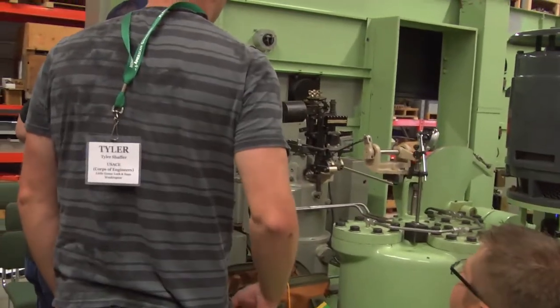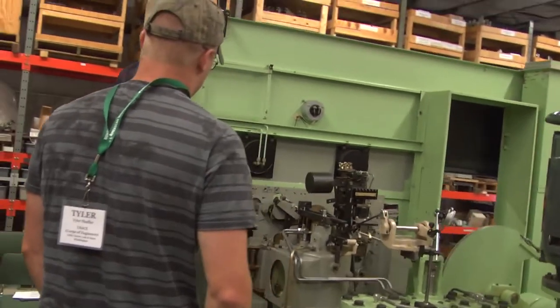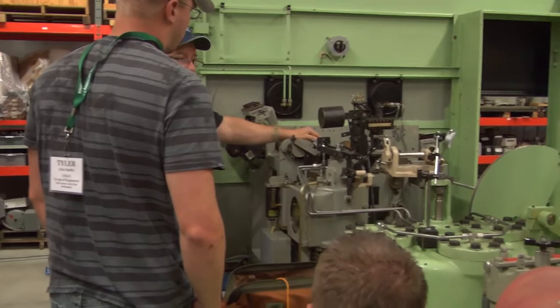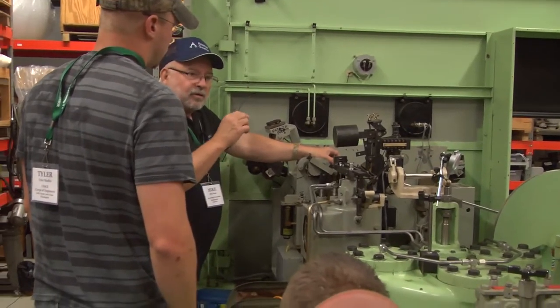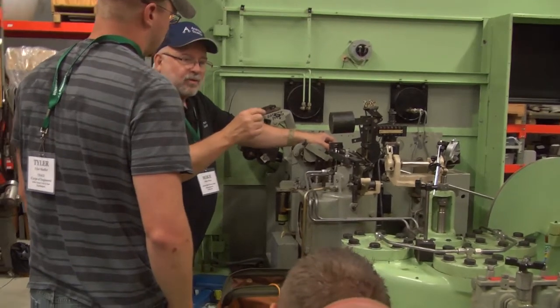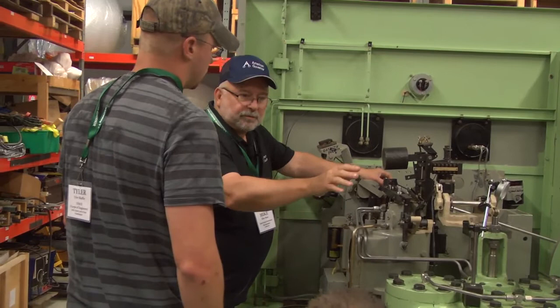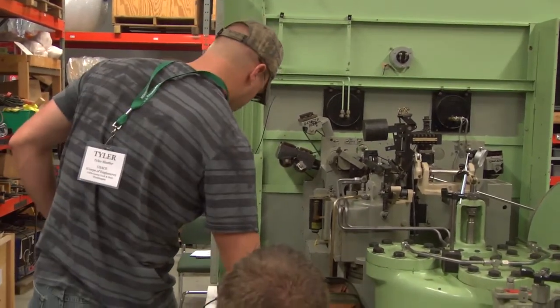For our purposes, all we'll basically have to do is lift it up and slide it where that lock is on the eccentric. On a governor, I never loosen to where it flops around. I loosen to where something has to push it or you have to tap it, because then you don't overshoot. Okay, so let me go up so you can get to it easier.